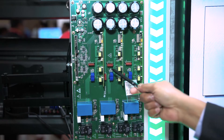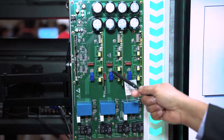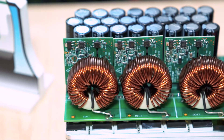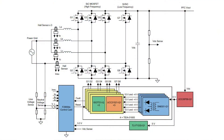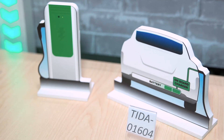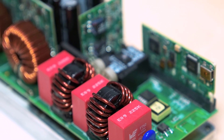Now what is very important is it's not just silicon carbide, but if you look at all these gate drivers — which are the single channel drivers out here — as well as the 6.6 kilowatt on-board charger, which has the AC-DC part with our dual channel driver. What is common among all these is, in order to drive silicon carbide, you need to have very fast response time. Because they switch so fast, you need to respond pretty quickly. And why is it important? Because these are very high power levels — 10 kilowatt, 6.6 kilowatt. You need to respond fast, otherwise something bad could happen.